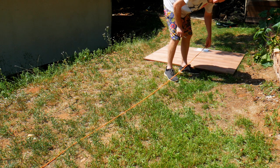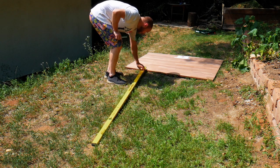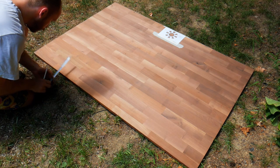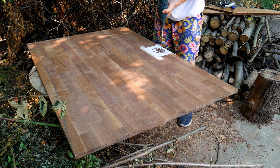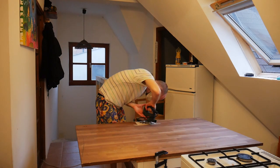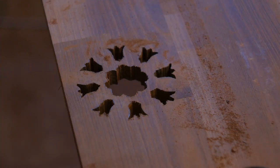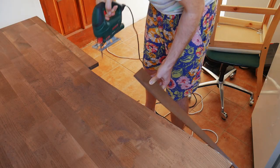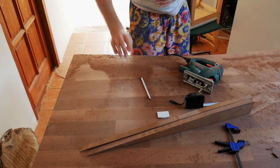After lots of thinking I decided to put a curve in the main desktop as well, but matching the shelf's curve would have been too sharp, so I wanted to find something else for a compass. I couldn't find anything, so in the end I drew it freehand with some guide points to hit. While cutting the curve I halved it and used one half as a guide to ensure it was symmetrical. It wasn't 100% precise, but worked okay.